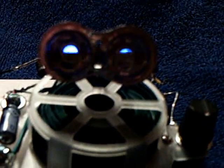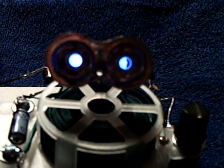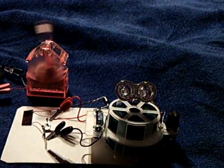I ran that power unit on this for several weeks just to see what it would do, and it worked quite well. Today I thought, let's go the other direction and see how small we can go. Right there is a little tiny solar panel — about a volt and a half, about 50 to 70 microamps — it runs one of those waving flowers. And that's a super capacitor, about half a farad. I'm going to see how many hours that's going to run on that half-farad supercap being charged up by that little solar panel in the indirect solar energy situation and the room light.